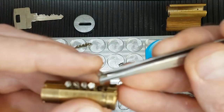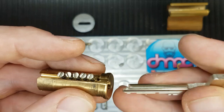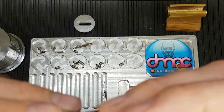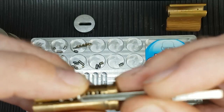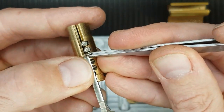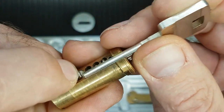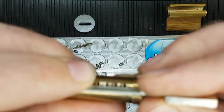These little springs just drop in here — let's zoom in a little bit so you can see what I'm doing. When you're working with these really small springs you've got to be super careful — not like that, because they just tend to fly about everywhere. That's five springs all sitting in there where they should be. If you look at these finger pins, you've got hollow on the bottom and that side — that hollow goes towards the spring, and the cut in the pin needs to face the sidebar.